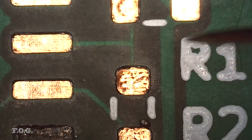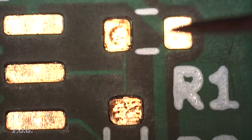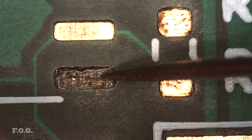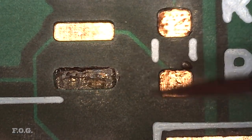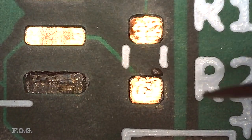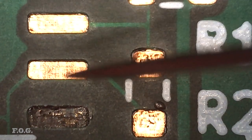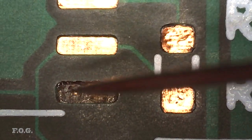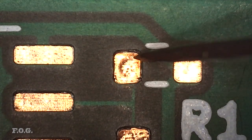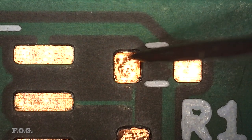Obviously, one of the tricks you can do, and I think it's not a bad idea, and maybe I'll give it more attention, is just to make sure you have some heat sinking capability on some of these smaller pads or standalone pads. In my mind, I don't want to be dependent on the design to clear the pads, which is why I'm searching for the ideal setting that means I don't have to worry about the design. But at the end of the day, it might actually be unavoidable. You might actually have to pay some attention to the design to clear with this method.